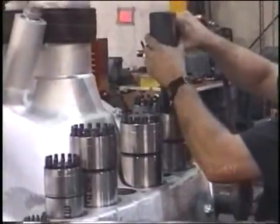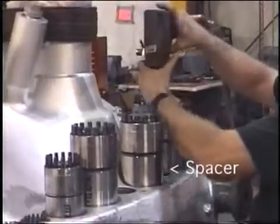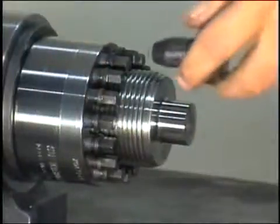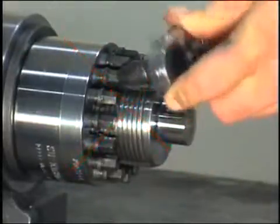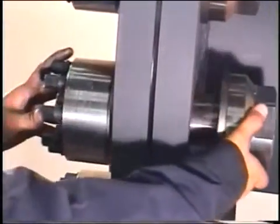For cases where the stud extension through the standard nut is excessive, a spacer can be used to position the Superbolt tensioners at the ends of the studs. This assures that the stud will not interfere with the socket when tightening the jack bolts. Of course, for through bolts, any additional thread can often be threaded through the nut opposite the tensioner.